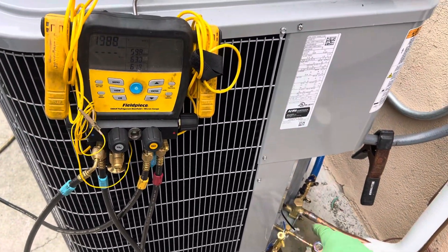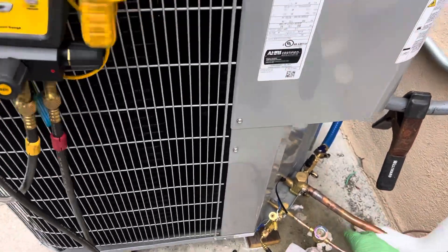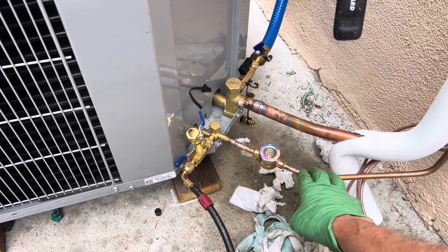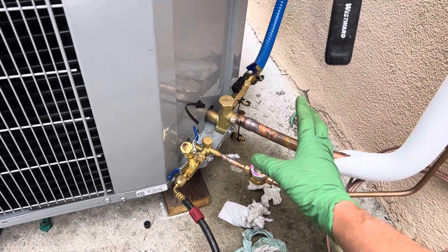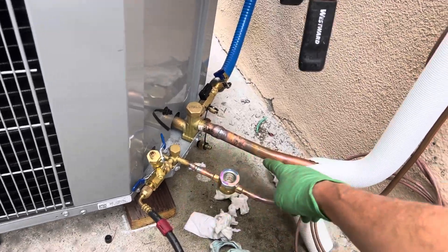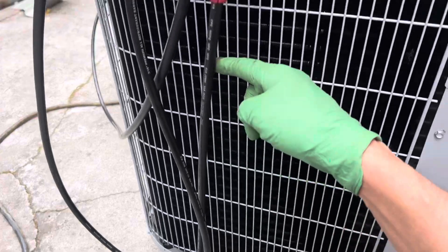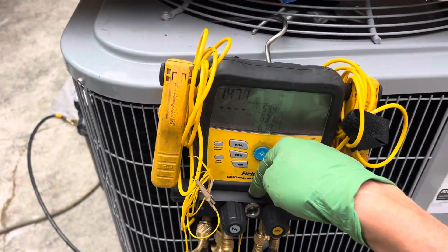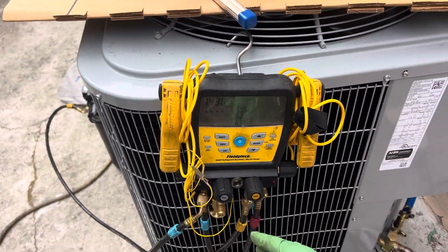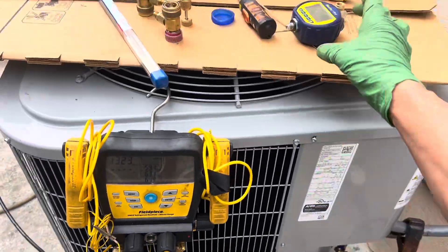You're going over 40 feet — I think it's like 42 or 47 feet through this line — and then it has to come 42 or 47 feet back through this line. So we're over 80, say 90 feet of complete distance before it has to go up three feet here, and the micron sensor is located right here. We're doing it through a hose, which we should not be doing — it should be directly off a dedicated micron meter.